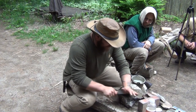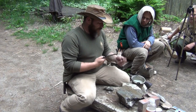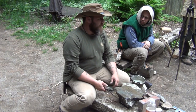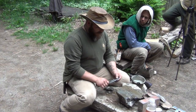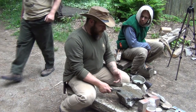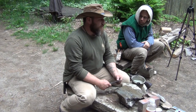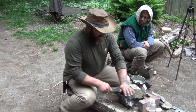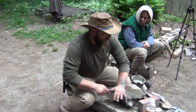A suggestion: when you first start out, get yourself a cheap knife, but something that's carbon steel. Don't try to mess around with stainless — stainless is too soft. Get some carbon steel. You can use a natural stone, but you might want to go out and get some king stones, some Japanese water stones, and then start sharpening. Just keep watching where you're taking your material off.